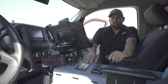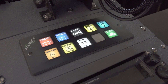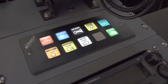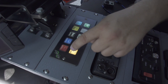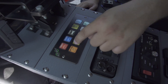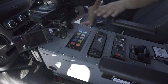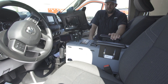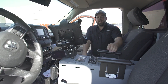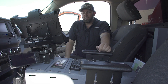With the AceTech electrical system, our switch panels change up a little bit. Instead of the rocker switches typically seen on the console, there are just touch-button switches — super easy to use, with a light that comes on telling you the circuit is activated. We've added the MDT center there for the customer, installed their radios and portable radio charger on our custom powder-coated aluminum console.